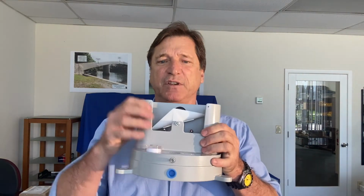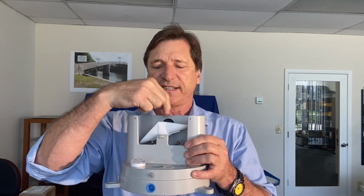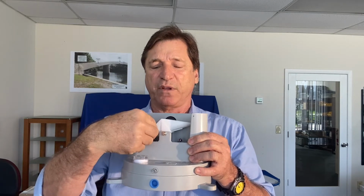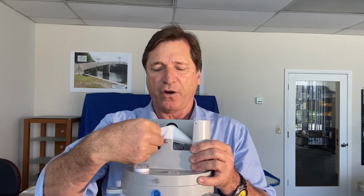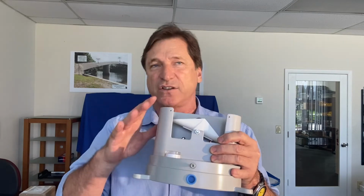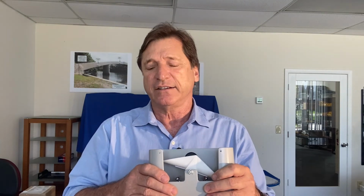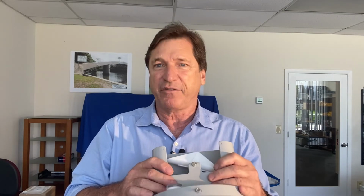The reason for that is simply that as a bucket is filling from the nozzle down into the bucket and the bucket is moving through an arc, additional water is still coming in until the bucket passes the central point. So rather than go into an exceptional amount of detail, all this basically means that at low rates, it's not that critical, but at higher rates, and particularly now where we have so many cloud bursts and high intensity storm events around the world, as that intensity goes up, without a correction, the rainfall data will be significantly impacted by the underreporting of the gauge.